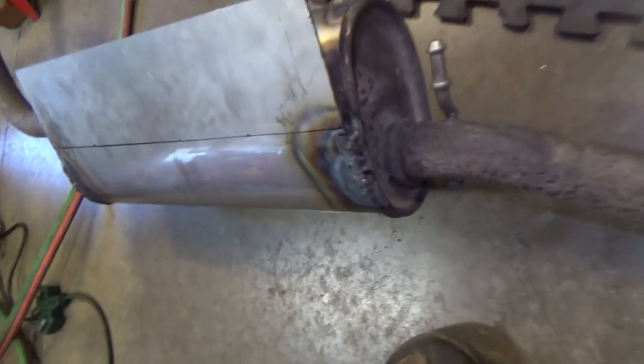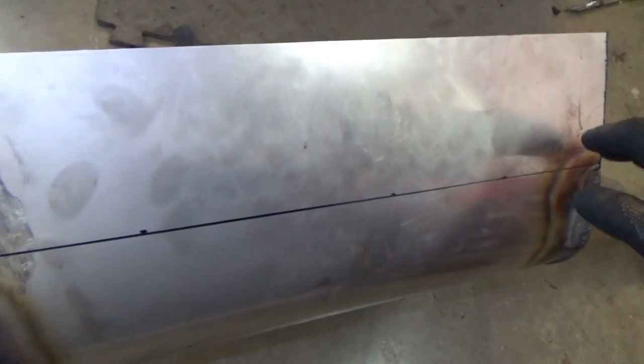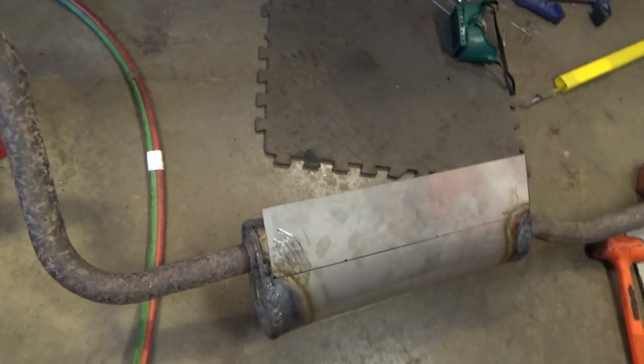I've welded it all the way around to here. Now I just want to cut off the remains — about four inches with the grinder — hammer it flush, and then weld the seam. That should be good to go. The remains are ground off. I cut a little stress relief here so I can hammer the outer piece tighter to the sheet metal, then weld along there, finish up the sides, and this thing should be beautiful.